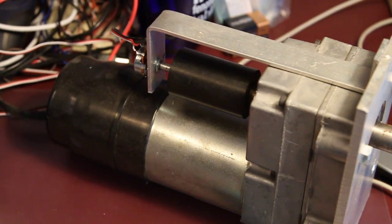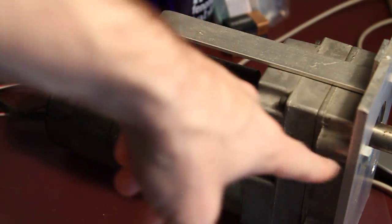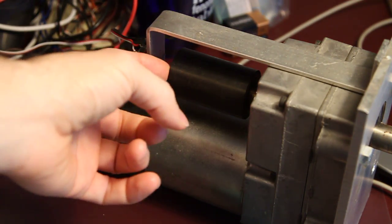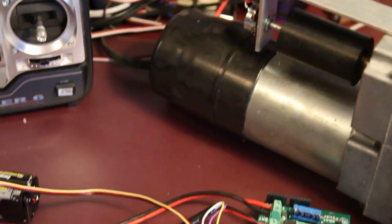What I've got here is a piece of plastic machined to fit over a shaft. This is a through shaft — it's the same shaft right through the mechanism, and it's a friction fit. That's important because if the motor goes out of control, it's not going to wrench the pot and destroy it. It just slips. The friction fit is tight enough to give me an accurate position, so this is an example of a homemade servo.